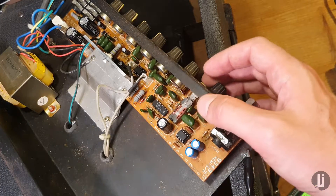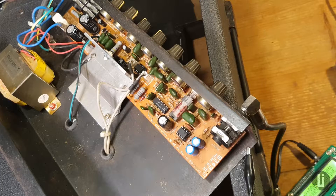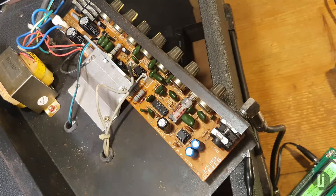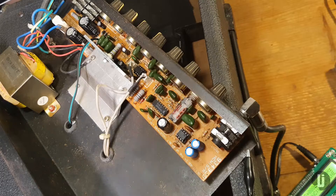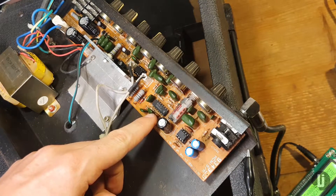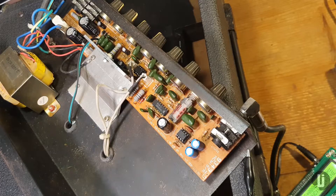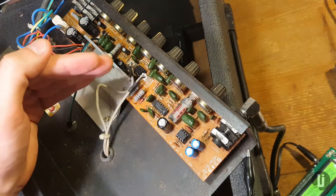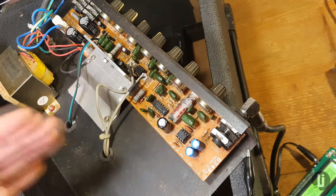There's also the 'I want to be a Marshall' channel, which produces distortion. How are we producing distortion here? That's where it gets interesting. Ignore the other TL072, that's for the reverb. We've got no op-amps left, no transistors, no diodes, no clipping LEDs — nothing. The only thing here, and what makes this amp so interesting, is a CD4069 — that's six logic gates, inverters. You give it a zero, it gives you a one. You give it a one, it gives you a zero. So if you give it a sine wave, it's going to be turning on and off — that's a square wave.